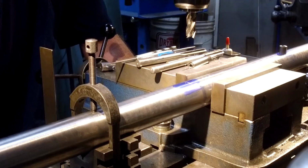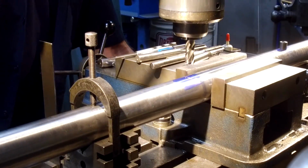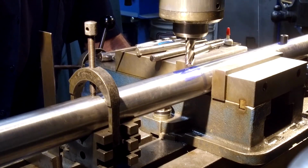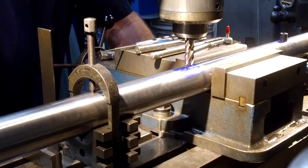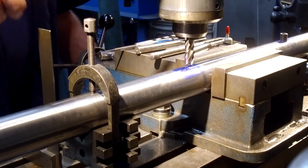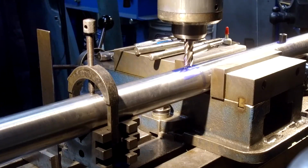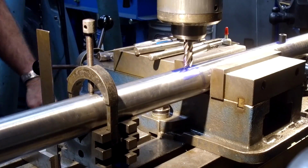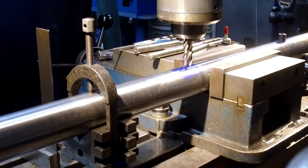Okay, we're bringing this up a little bit. We've got our end mill in there. We want to leave a little bit of room for our spindle here. Okay, and it's locked, the knee here. Alright, we're pretty well set right there. Move our handle up. We're going to engage this in here so we have some control. Alright, and we are still at 0.775.